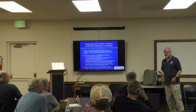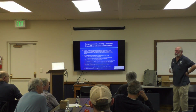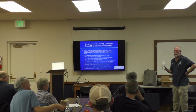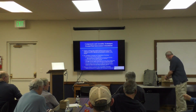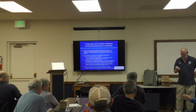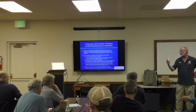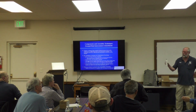Where do you find it? That company from Utah sells it. Almost every ham radio company sells this. It's called antioxidant, and there's a copper to copper and a copper to stainless steel version. That's this stuff, because stainless steel has a similar electrical potential to copper. And this is a different brand made by Burndy. It's called Penetrox A, and it's designed for making aluminum to aluminum and aluminum to copper connections.